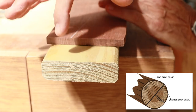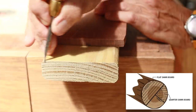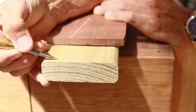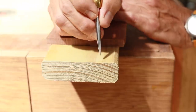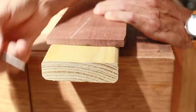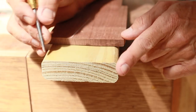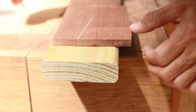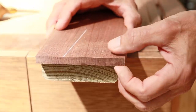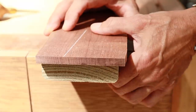Unlike this piece of decking board where you can see the annual rings run across the face - in this case, this board would most likely cup pretty drastically, meaning it would dry out the oils and moisture more on the surface than on the bottom. This piece of walnut, on the other hand, is about as quarter sawn as one could get.